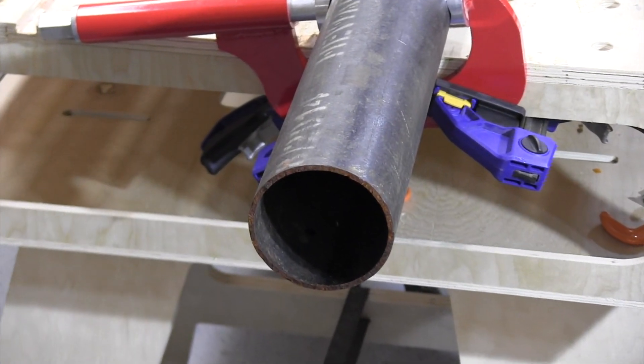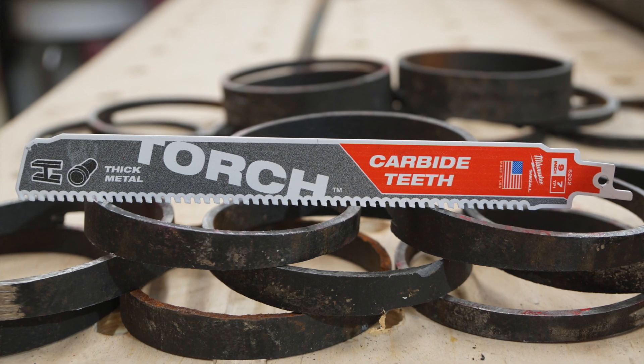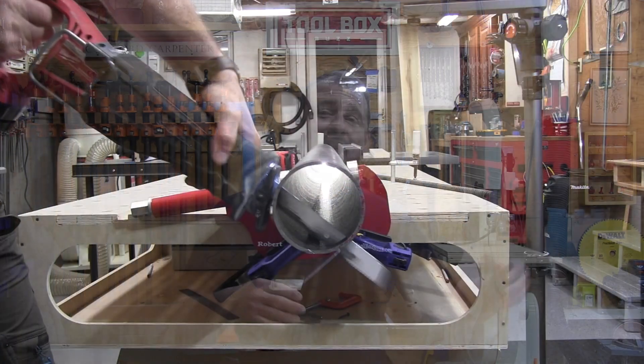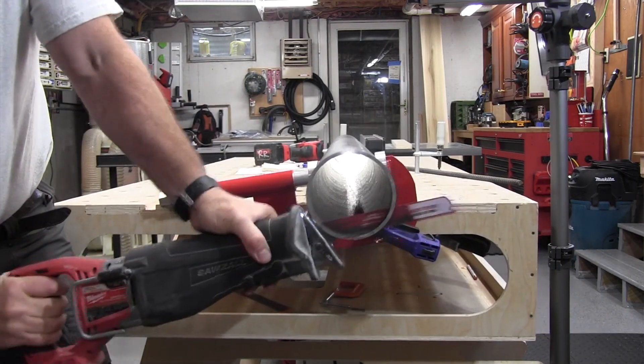The next test was a four-inch black cast iron pipe — what you see in residential homes — with a five-sixteenths inch thick wall. In restricted access, a diamond grit blade is what we always used, but it takes a really long time. The Torch blade can reduce the cutting time from two minutes down to 30-plus seconds. I compared the Torch against the Diablo Steel Demon carbide blade, performing two tests each with fresh blades and averaging the results over eight cuts. The Milwaukee Torch cut the pipe in 45 seconds; the Diablo in 44 seconds.